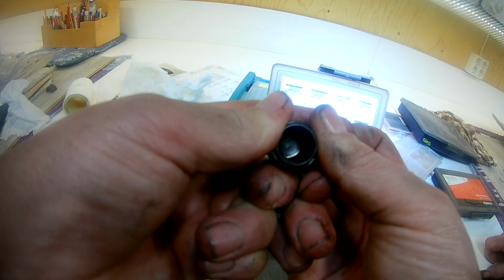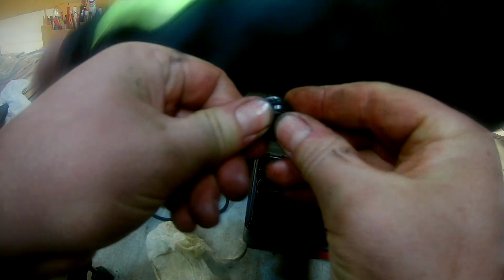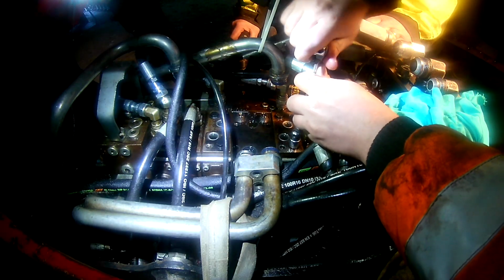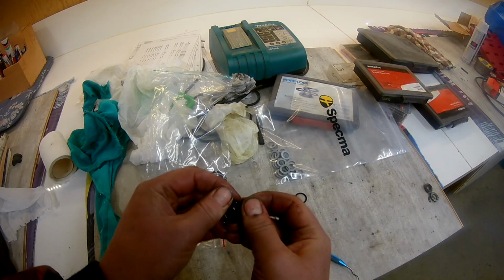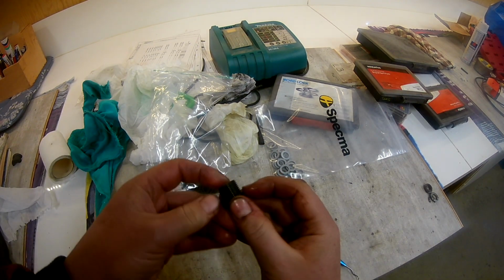Tried putting one of these O-rings from the hose connectors on the harvester head and tried bolting it in place, but there was no resistance even towards the end, so I felt it was a little too thin, not enough meat on it, so ended up buying a couple.